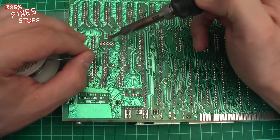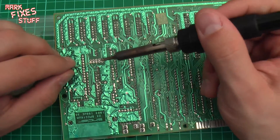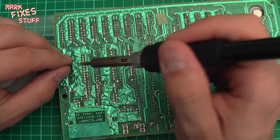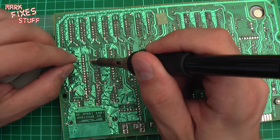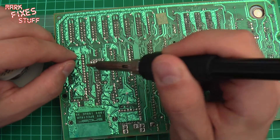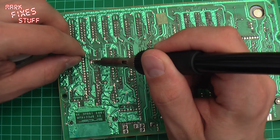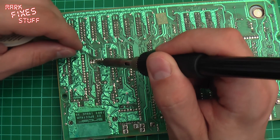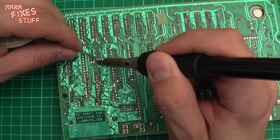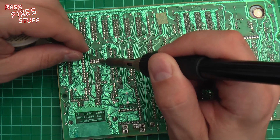People keep asking me why I use a green mat — it's to protect the table, it's that simple. So let's grab some leaded solder — lead-tin amalgam. You don't need to worry about using leaded solder; it is not illegal regardless of what people tell you. Missed that one — always do both ends first, really. Heat the component and the pad at the same time so the solder flows evenly onto both.